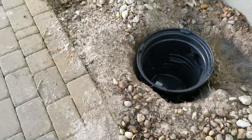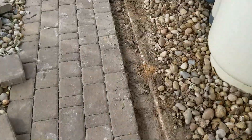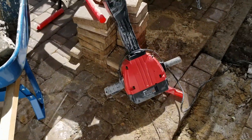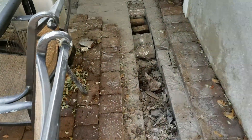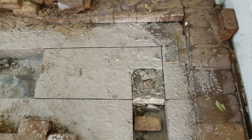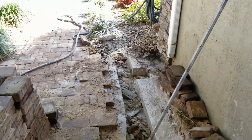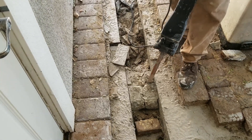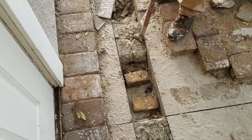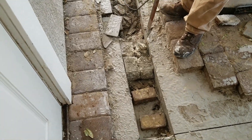On this side we've got the sump pump basin installed and we're ready to trench the line — it'll go right alongside the pavers. We had to pull a few pavers and we've got the jackhammer back here because the concrete was so thick. We'll trench the line over to another catch basin right here in this corner, and then it'll be gravity from that catch basin as it turns and runs all the way out to the lake. If you happen to have a jackhammer, great — makes life really quick and easy.